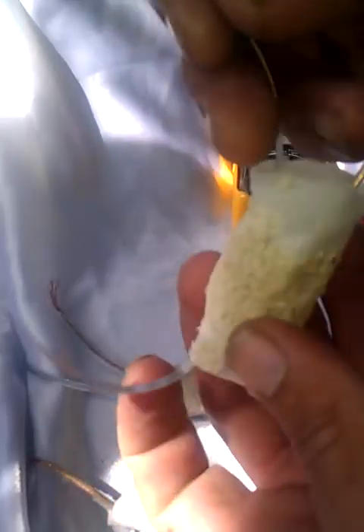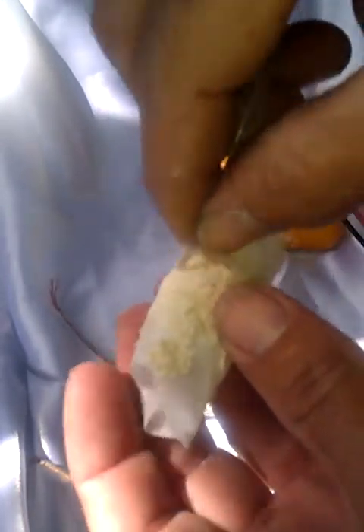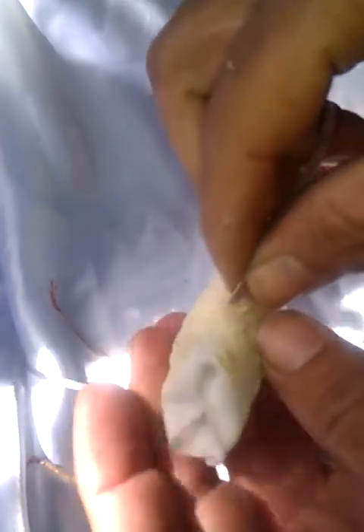The sodium alginate is doing a really good job. It's been 3 days and I was still able — even without having to water it — to still have a little bit of sodium alginate right in here after about 3 days. It was still enough in here to push the magnesium in and I was actually getting about 1.5 volts. So another factor on the next series would be increasing the thickness of the gel to keep the moisture.